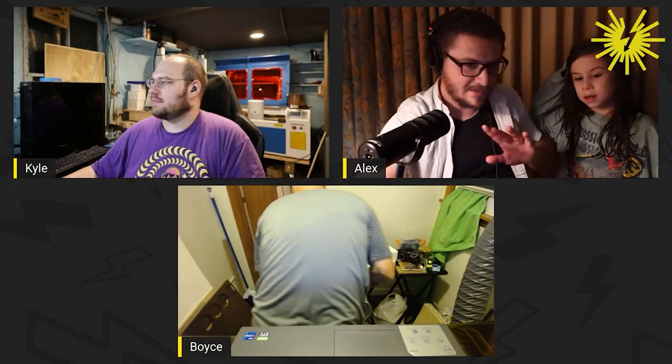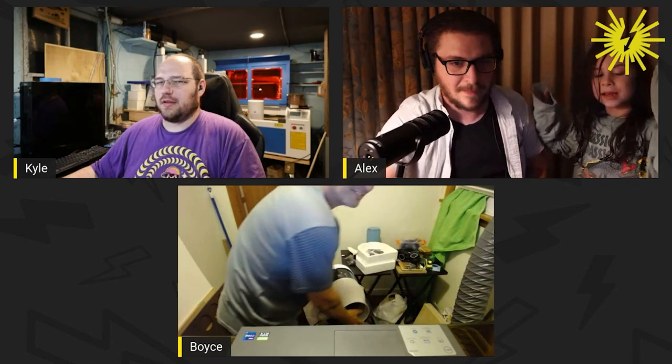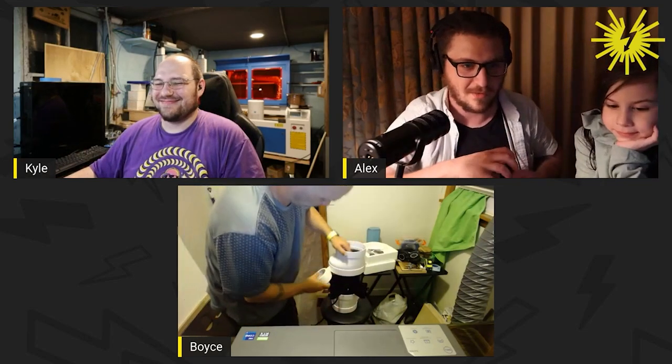The other thing that I could do that would make a huge difference is, all the way up until the point that it's like the hose on the desk actually being bent and turned in order to point at the thing I need it to point at, solid ducting. From what I've heard, you lose a ton. Say hi. Hi. Hey, Felix. From what I've heard, with the ribbed collapsible ducting, you lose a ton of pressure because of the flexible walls.